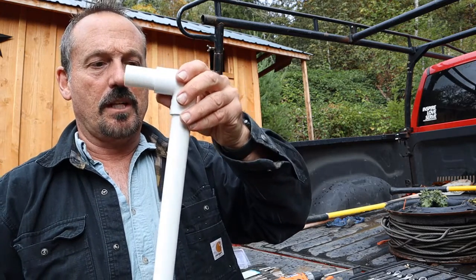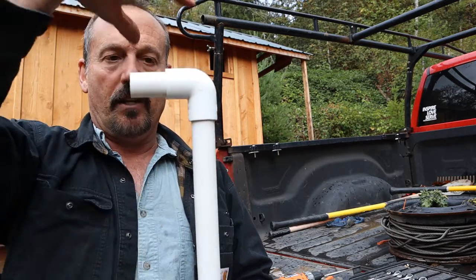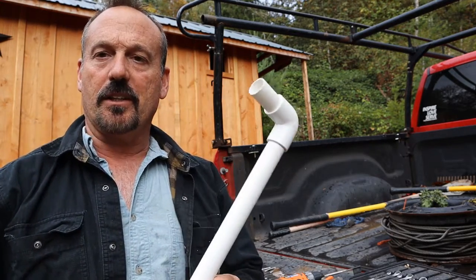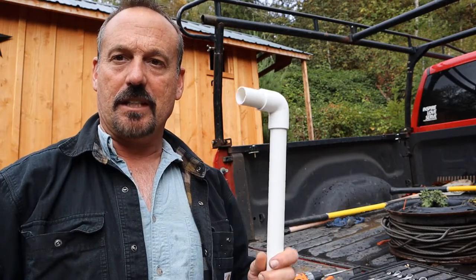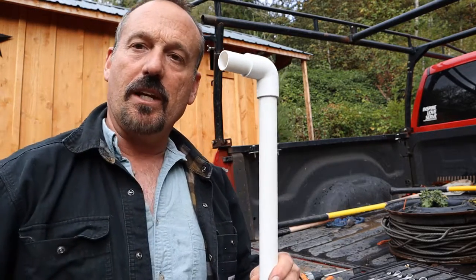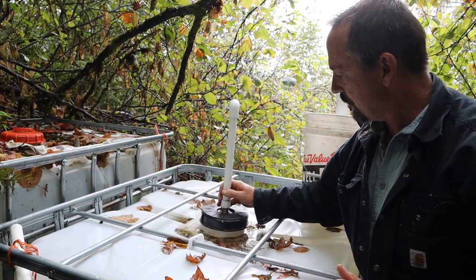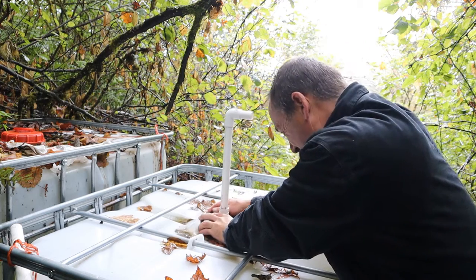We'll be placing this elbow on top so that nothing's coming in. I have another elbow but I left it at the house. I want to turn this so it's down so no rainwater or anything falling is going to come into this system. The other beautiful thing about doing this is when I have closed tanks up there and they try to run water down here, it pulls down and creates a vacuum in the tank, slowing flow and losing pressure. But by having this airflow opening, when the water needs to flow out, air can flow in, and that allows the water to travel freely and keep the pressure it needs. So I'm just going to screw this cap on tight and hope that the gasket on the inside seals really well.